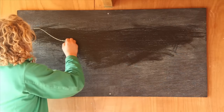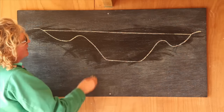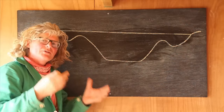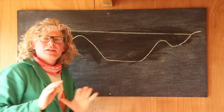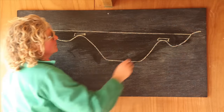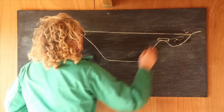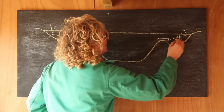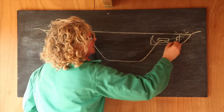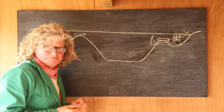We came up with something less like a pool and more like a pond. I suggested doing a profile more like this — there's the water level, and the swimming zone is defined by sloped earth walls at about 60 degrees, depending on whether your soil can tolerate being sculpted this way; it definitely needs to be free draining. The liner is placed over the slopes, and on top of the earth walls we cap it with stone. Here is the regeneration zone filled with gravel, pipework, and plants. For circulation we have an airlift pump in the planted zone. Normally the airlift pump terminates into the swimming zone, but we can't puncture the liner here, so we keep the airlift pumps within the planted zone. It's a simplification of the system but quite elegant.